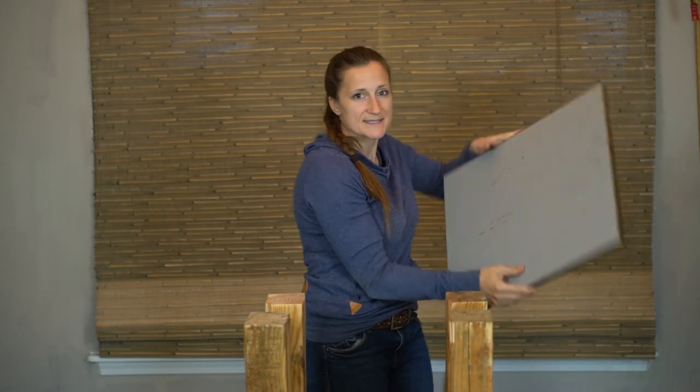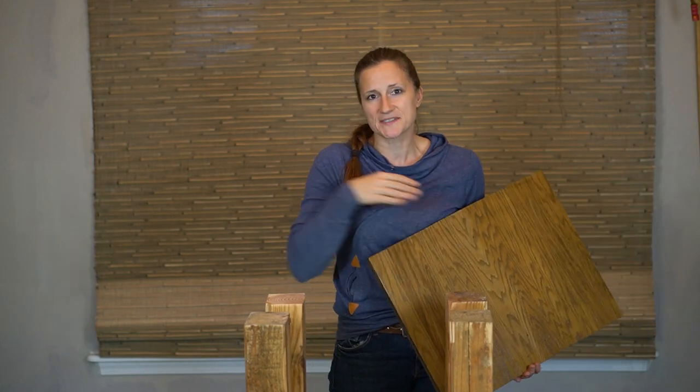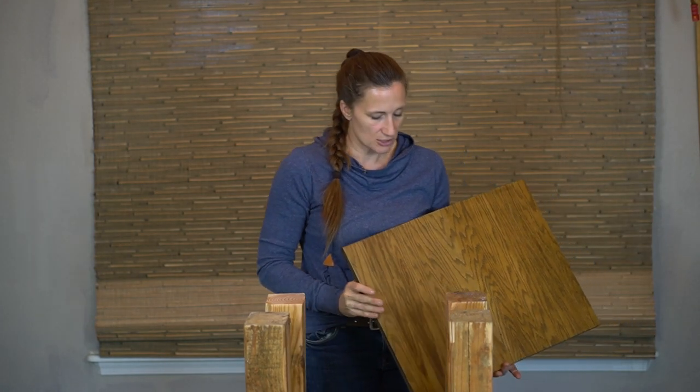You can hold it yourself, but who wants to — so let's go ahead and put the top on. Mine has a stained side and a painted side. The top is going to be completely covered by the padding, so I'm going to put the stained side down, and you'll be able to see that if you're looking from below — which maybe it's just the cats that are going to enjoy that part. This one is designed to go one inch in from each edge, so I'm going to grab my measuring tape to make sure I'm right on the spot, and we're going to get this put on. Again I'm going to use the three inch screws for this.